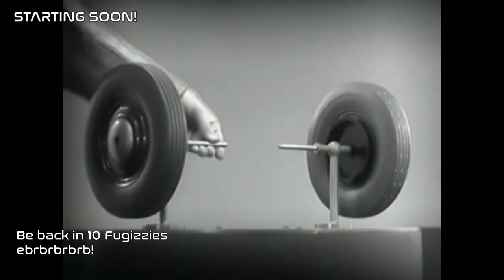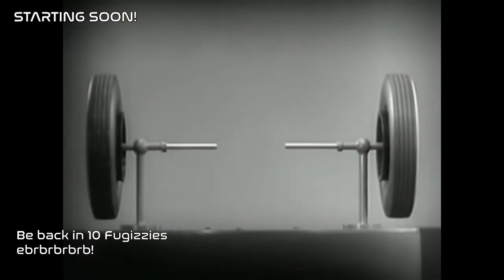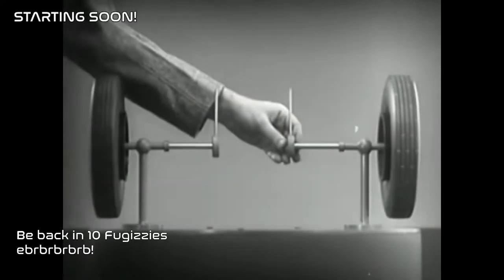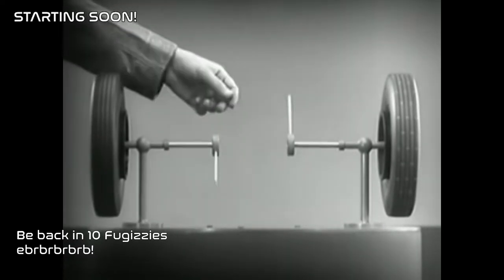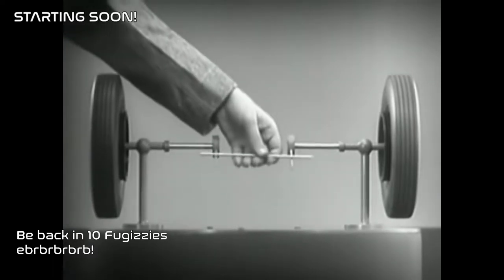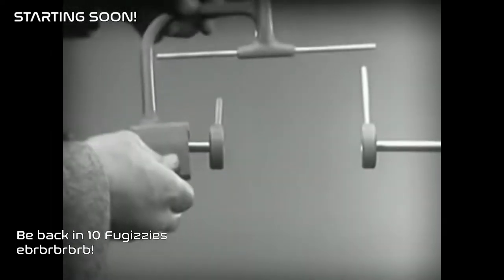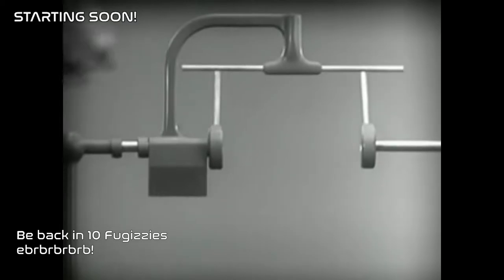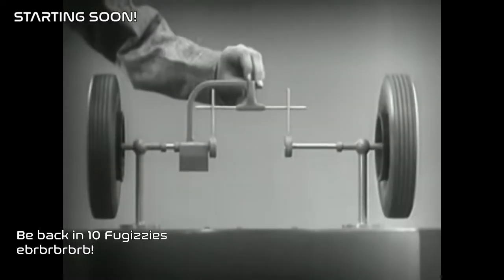These two wheels are mounted on separate axles and supported by a frame, so that they can revolve freely at different speeds. Let's fasten a spoke on the inner end of each axle, so that by turning the spokes, we can turn each wheel separately. With a bar or cross piece, we can turn both wheels in the same direction at the same rate of speed. Let's get something to hold this bar in place so that it will press against the spokes. Notice that this support is not locked to the axle. It turns freely. Now, we can spin the wheels by rotating the support.